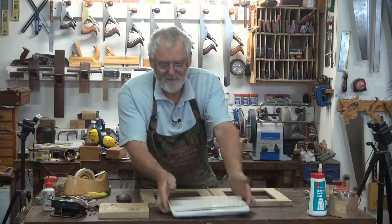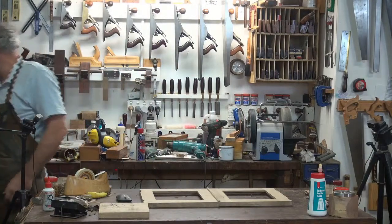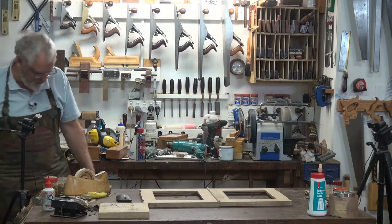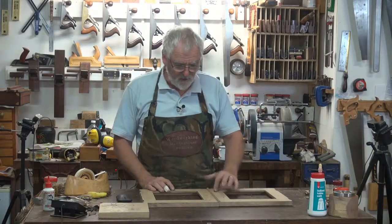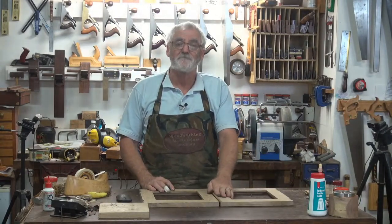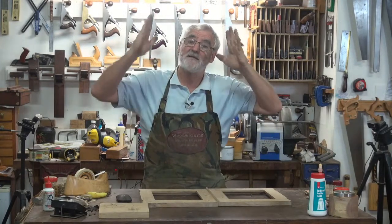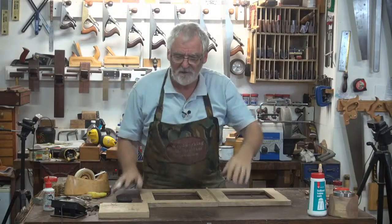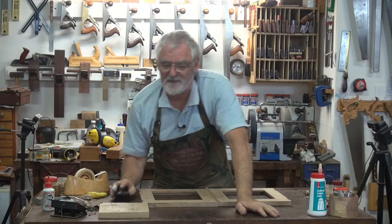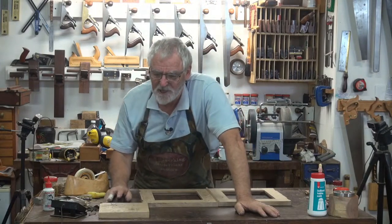You're absolutely right there, Earl. Those Yankee screwdrivers create more work than they solve. The best thing they're for, really, is on old tables, antique tables and that, when you're screwing the buttons in underneath. So you're underneath and you've got a mate on top holding it down, and if it slips out of the button, it doesn't matter. But I wouldn't use it on any area where you can see stuff.